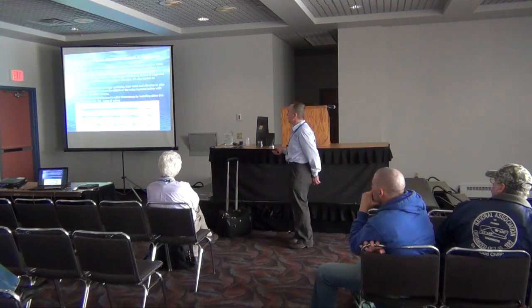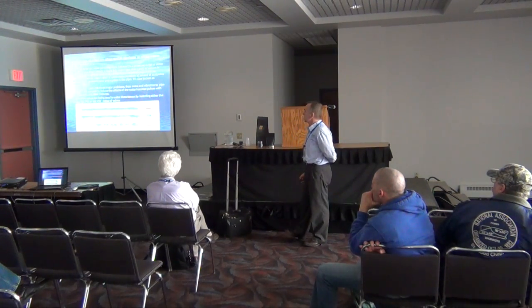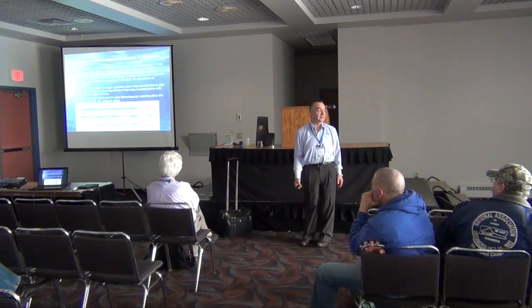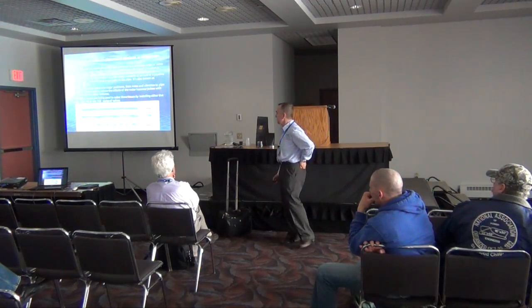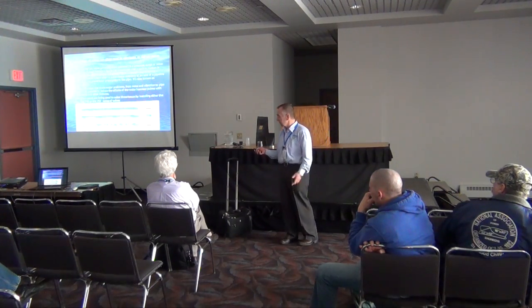The next two series of valves are often used to eliminate or diffuse water hammer. Water hammer — more generally called fluid hammer — is a pressure surge or wave caused when a fluid, usually a liquid but sometimes also a gas, in motion is forced to stop or change direction suddenly. It commonly occurs when a valve closes suddenly at the end of a pipeline system and a pressure wave propagates in the pipe, also known as hydraulic shock. This pressure wave can cause major problems from noise and vibration to pipe collapse. It is possible to reduce the effects of water hammer pulses with accumulators and other features. The ProFlex valves are being used to solve these issues by installing either the inline 720-740 or the 750 series of valves.